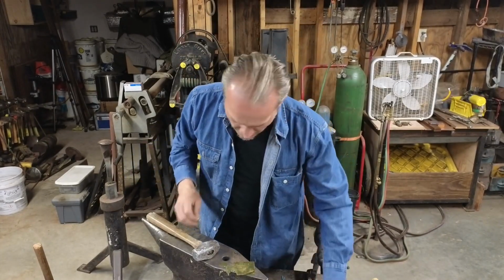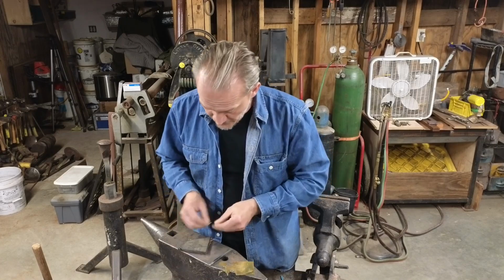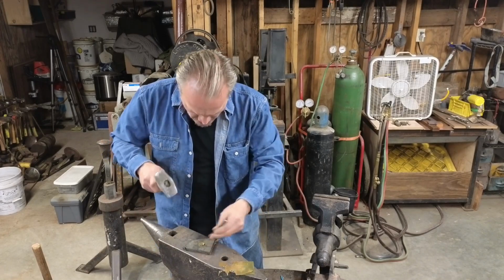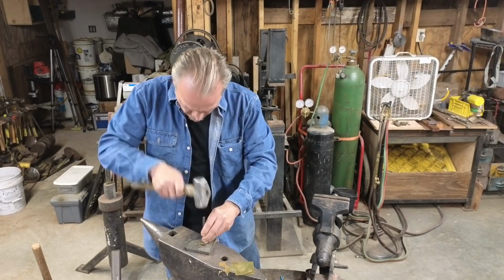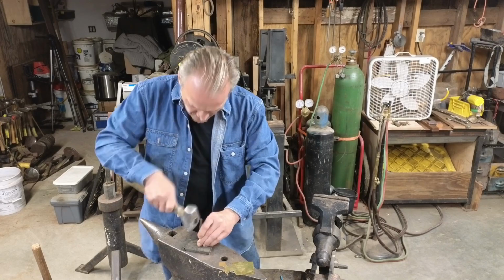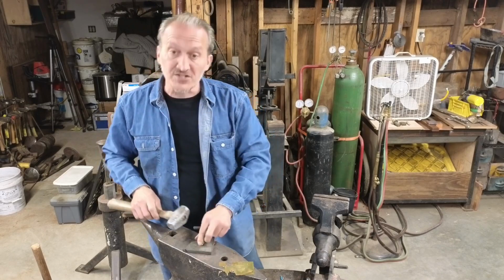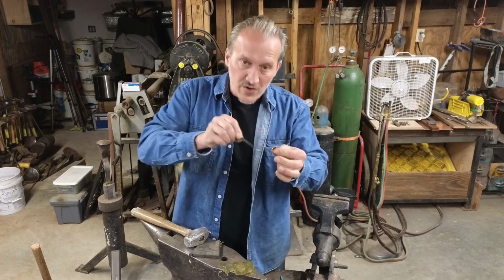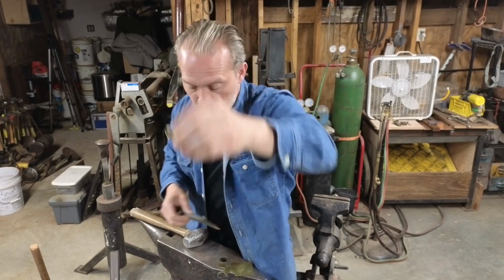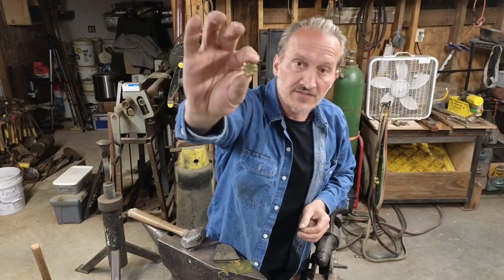I'll go ahead and actually stamp this one out, show you how it comes out. I've got a little piece of rubber here, the rosette, and a dome punch here. I'll just show this one real quick how it goes. One could potentially make a little multi-headed tool that would strike all of them at the same time if you wanted as well. It's kind of warped up a little bit. No problem. Set it back down, put the rubber on top of it. Give it a smack. Flattens out nicely then.